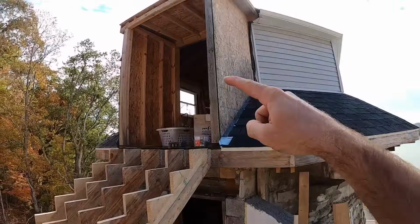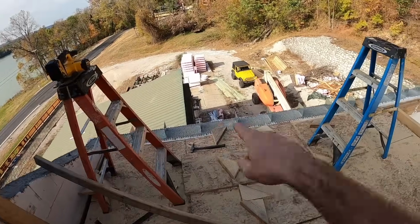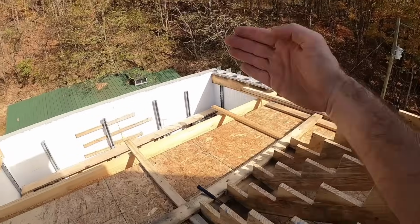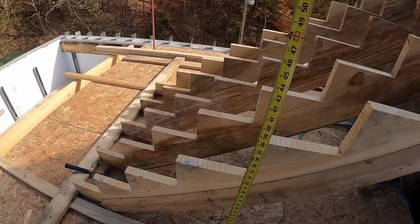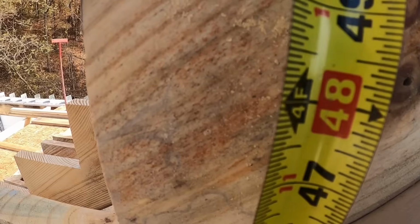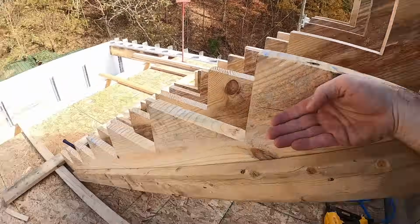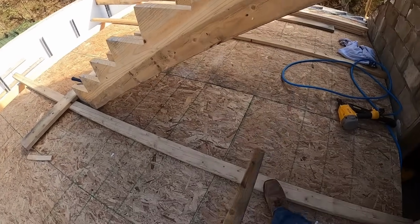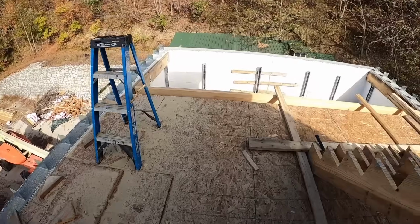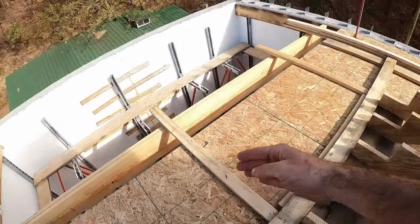But I do know I'm going to have a vertical wall here that goes all the way up to the top. That's where we now have a wall to tie in our rafters, which will come all the way out and all the way over top to create an overhang. So if you can imagine a vertical wall here at 4 feet up, 4 feet. So let's use the stringers to give you guys a really good visual. So basically there's 4 feet right there on that stringer. So at 4 feet, that's the top of rafter. And then that rafter will run basically, and it will not be a 2x4, but that rafter will run onto this wall and out to that outside edge. So this entire side will be pitched.